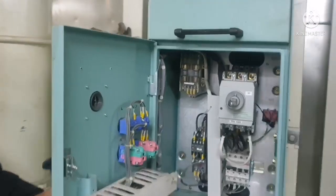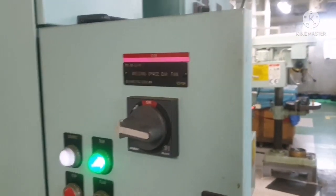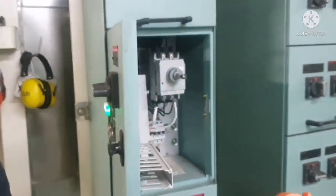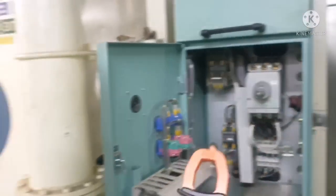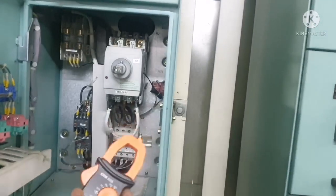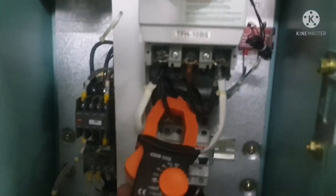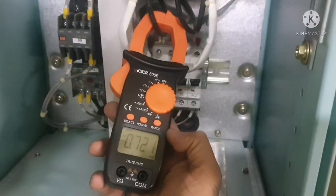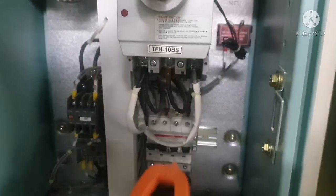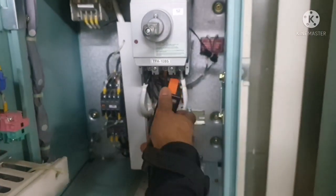You can see this welding space exhaust fan is running. Now I am going to check the current flow in all three phases, because this is a three-phase motor and it has three cables. First, I will clamp it and I can see the value 0.721. You don't need to fix it like this — you just need to hold around the cable, that is enough.